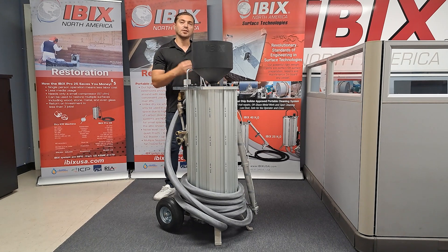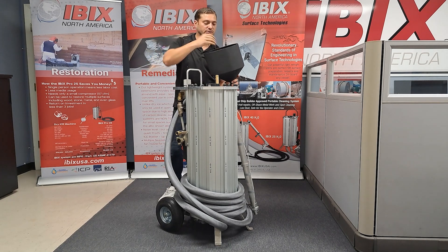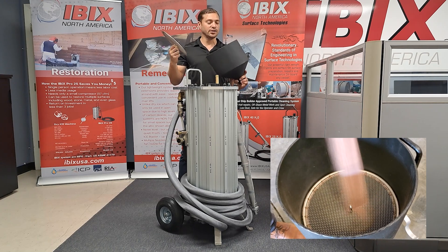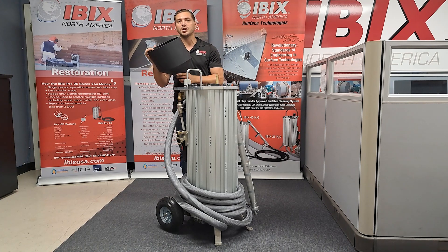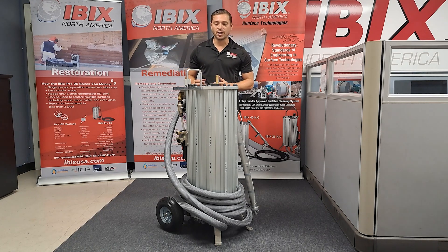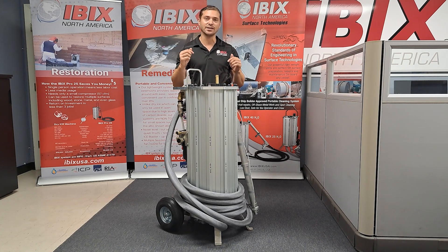Upon taking the Hi-Pro 60 off the pallet, you will have a filling funnel as well as a screen. If you are using a reusable material such as garnet, which can be reused up to five to seven times, the screen does a great job at filtering out any larger particles or foreign elements that may mix with the material. This funnel holds a perfect 40-pound bag, so you can put the whole bag in at once. The Hi-Pro 60 is a pressurized pot, so once you pull the trigger the flapper door will seal 100%, so nothing can get inside or exit the unit when you have a trigger pull.